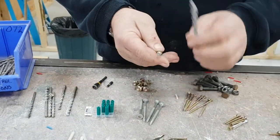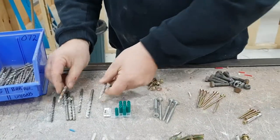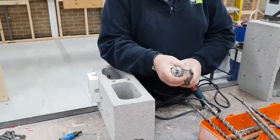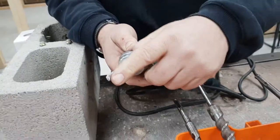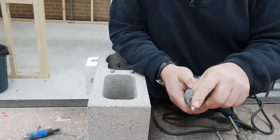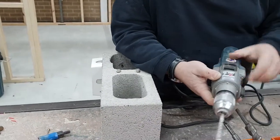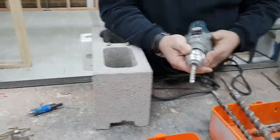These are all the types you'd buy for a normal drill bit — all different sizes. After a period of time they do become blunt. You can't really sharpen them. Some people think putting a point on them will sharpen them, but for the amount of money you pay, it's just worth getting rid of and buying a new one. Make sure you have the drill on low speed — hammer action is not about speed. Going too fast will cause the bit to get super hot and self-destruct.